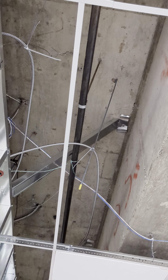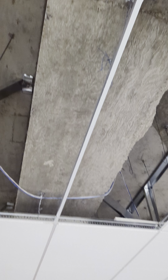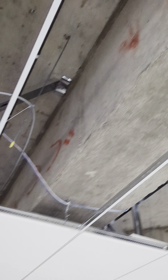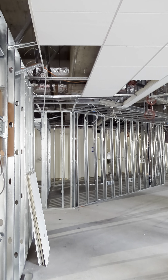You don't have to go to the ceiling. They could have gone to the bottom of this, as long as it's above grid, which it is. They also could have shot directly over here because 90 degrees is okay — you're trying to prevent a wall from shifting side to side. So 45 is ideal, 90 is acceptable, and negative 45 would work too, as long as it's not visible.